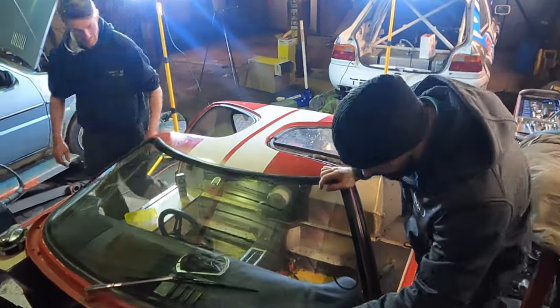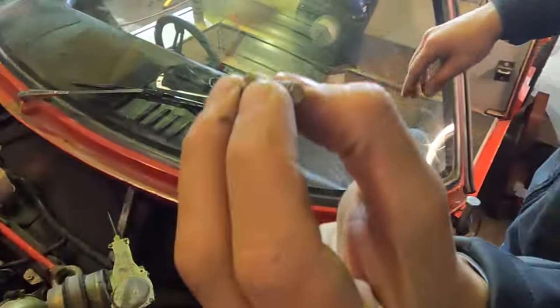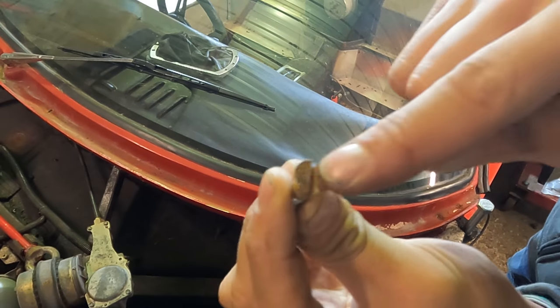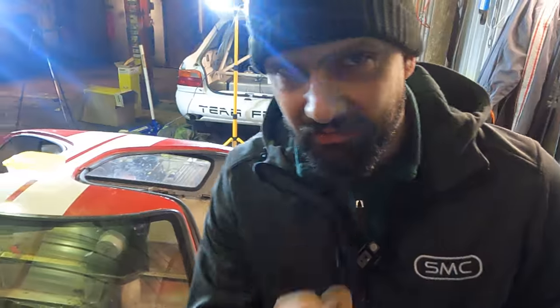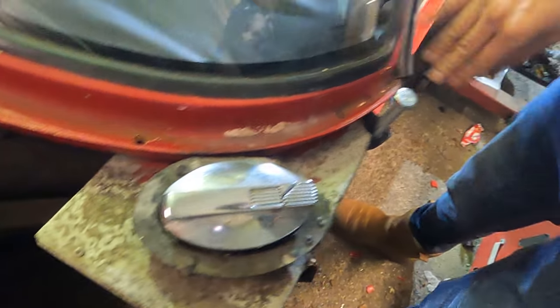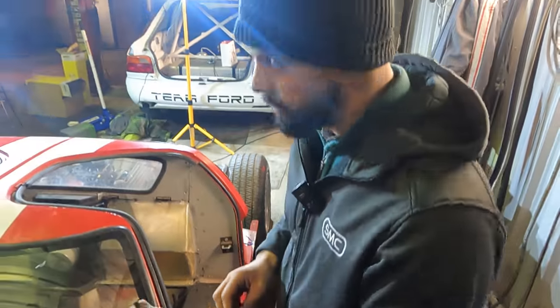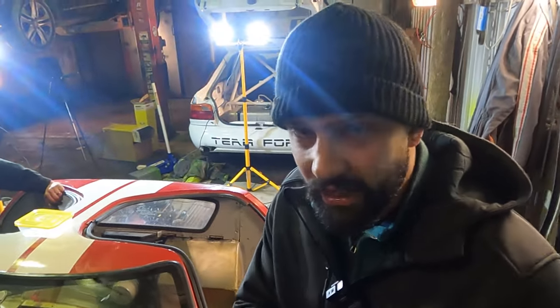So we've got these little flat screws — an eight mil stud, probably American, UNF or UNC, and it's a flat-headed bolt. There are a couple of problems with it being a flathead. Ivan's done a lovely job because these can be countersunk and hidden so when the rain comes down it runs off nicely. But a countersunk flathead is an absolute nightmare for its integrity of strength because when you have any water sitting here it corrodes the head and makes it very, very hard to undo, as you're going to see now.